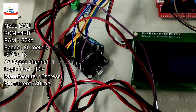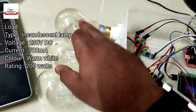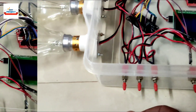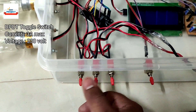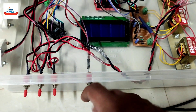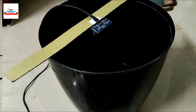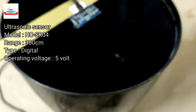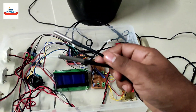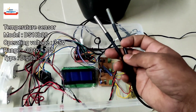The next component is a Node MCU to send data from Arduino to the IoT server. Some sensors are also connected to Node MCU. We are using three loads — R, Y, B — to demonstrate the system. Their rating is 200 watts each. These switches turn the lamps on and off for demonstration, and this switch is used to demonstrate a Buchholz relay fault condition. In real life, when a Buchholz relay fault occurs it goes high. This switch is also used for oil level measurement of the transformer — you can see a small amount of water inside the tank for demonstration. The last sensors are two temperature sensors: one for winding temperature and one for transformer oil temperature. Both are waterproof so they can be placed inside liquid without fault.